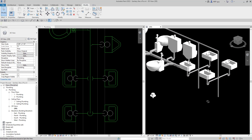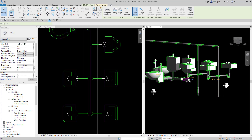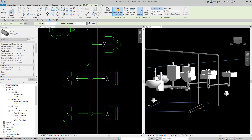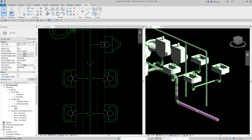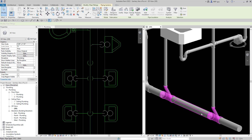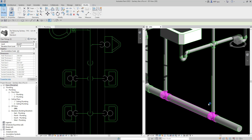Let's orbit around a little bit. I'll click on this piece right here and draw a pipe, dropping it down to negative two feet, staying in the 3D view, holding shift, and dragging it out to a point about right here. Now I can use trim and extend to trim those pieces together. I'm going to make them sanitary reducing T's like we did last time so they look a little cleaner and we save a little bit of money.